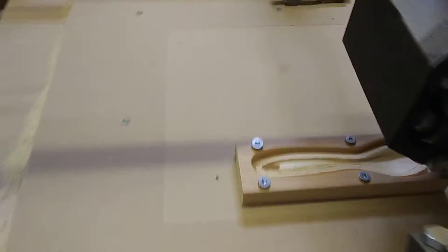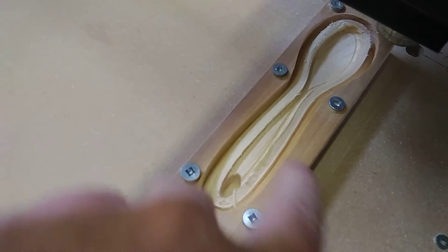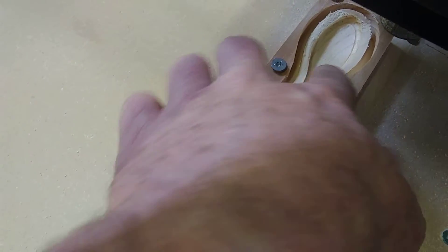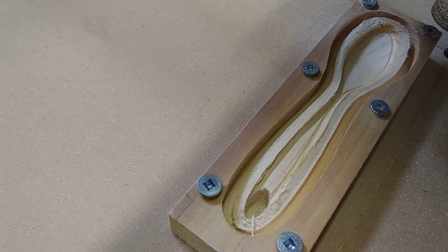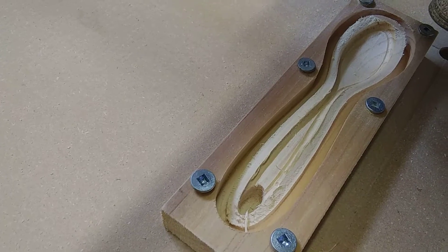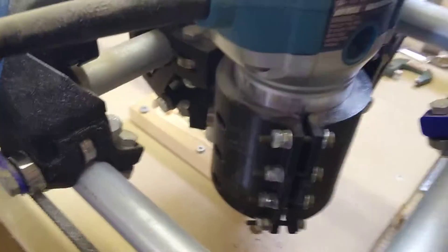You're cutting along fine, but if you look at the outer edge you'll see that it's deeper — I lost steps in the Z-axis. I came back and checked the height and everything the way I set it, and it looked like it actually did sink down 30 thousandths.